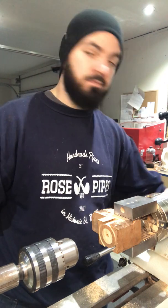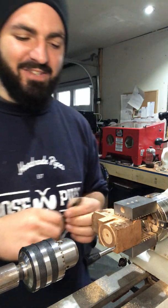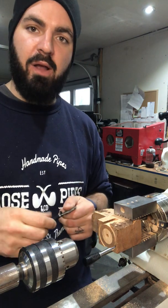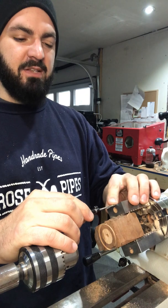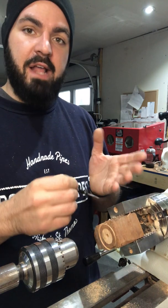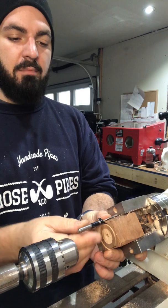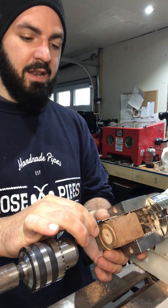So now all we do is we're gonna use, we haven't done this yet. I have to show you guys how to do this still. This is my chamber bit. We're gonna make one. So, bear with me. I'll do this video in like 5 minutes because of this now, and I feel stupid. So now, what you're gonna do is the same thing. You know where your lines meet. That's where you want the bottom of your chamber. So you're gonna take your bit, line it up there, put a mark on your bit. I use tape. I know where my bit's gonna end up every time.